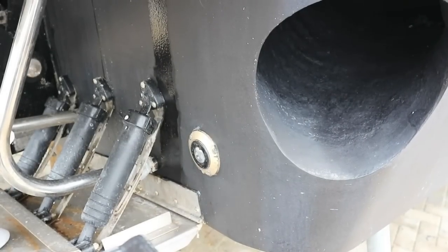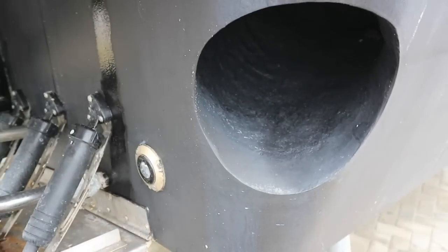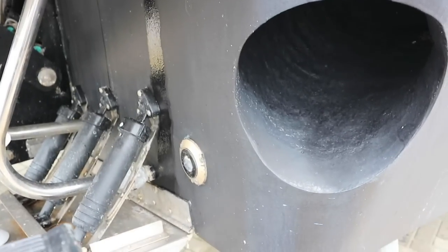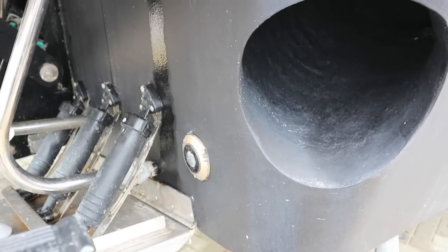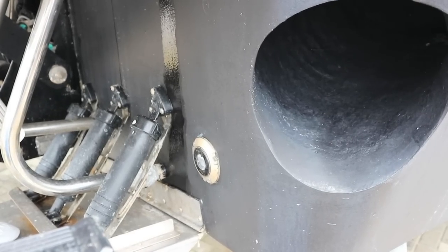One of the issues that you have with many craft, and this one is typical, we have a high-low bathing platform which has quite a large overhang, and we also have corner mounted exhaust, so the access to actually allow you to fit the lights on the inside and the positioning on the outside means that the lights on this boat will not be as effective as others, as they are a bit far down below the waterline, and I should think actually trying to get inside to fit them was dreadful.